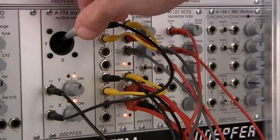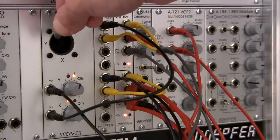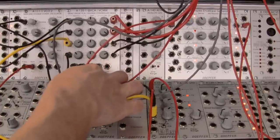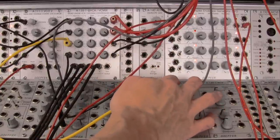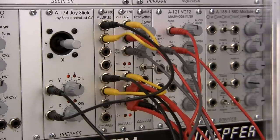We can see that it plays up in this quadrant, then if I go down to the bottom it does that, and if I go over to this quadrant you should hear it over there. If I go up to this quadrant you should hear it at around 11 o'clock. In the center we have zero. Now if you wanted to get a bit better atmosphere, you can increase the gain on the VCA — right now I have it turned all the way down. If we bring it up a little, it won't take you to quite silence, so we can still get a little bit of that spatial movement. When I'm at center I have a little bit of signal, so it's not so abrupt moving from nothing to the signal, and it just helps add to that sense of movement.